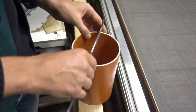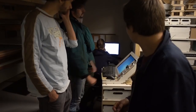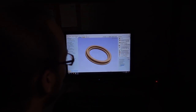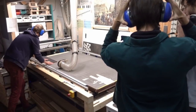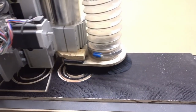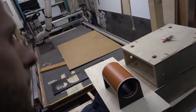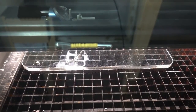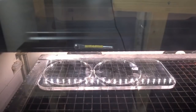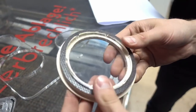Now we have to prepare the plastic input. For this we took two normal pipes, one slightly smaller than the other, and took their measurements. We milled fitting wooden parts for the heels and the fixation using our self-made CNC machine named Inge. If you don't have your own, just ask open workspaces or fab labs in your area. To provide more transparency, we cut two plexiglass circles with our laser cutter — if you're interested in this technique, check out our first video about plexiglass mold making. The plexiglass is fitted into the CNC wooden parts.